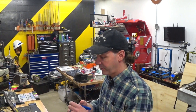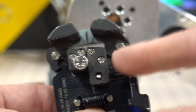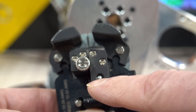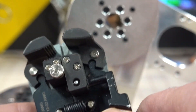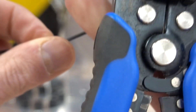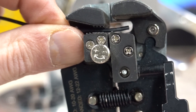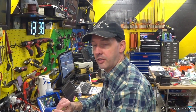So we're going to strip off — somebody commented that I don't use the depth stop here, and if you look close you can see why: the little screw for it just snapped off one day and I've never messed with it since. I use a backing thumb — I'll show you. The way I do this is I come in and I have my thumb, the distal end of my thumb, and that holds the wire from getting pulled through with the silicone wire. That's the thing that helps.